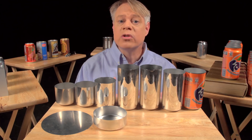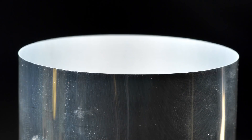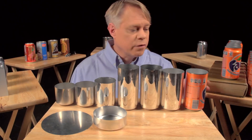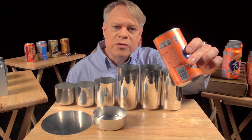Now, if you look closely at the top of the can body, you see that the edges are wavy and uneven. These irregularities occur during the forming. To get a nice, even edge, about 6 millimeters is trimmed off of the top. With an even top, the can can now be sealed. But before that sealing occurs, a colorful design is printed on the outside — the term of art in the industry is decoration.